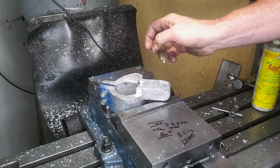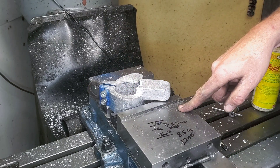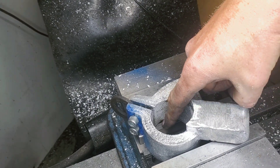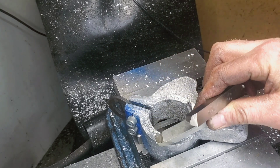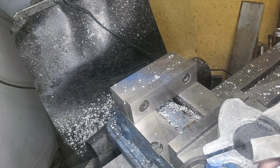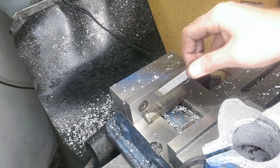I'm going to put this washer in here and clamp down my gap of roughly an eighth of an inch — it's going to hold it pretty steady and give me that clamping diameter later on. Can anybody spot the mistake? That's right — the parallels are going to bottom out right there in the bottom when I go to bore this. To solve this, I've got a really old school cheap method: I'm going to grab some high-speed steel out of my drill drawer and put these in here. This is probably going to be within a half a thou by the time we're done.